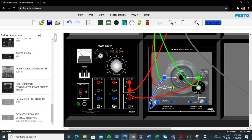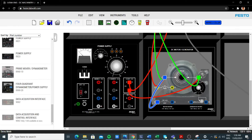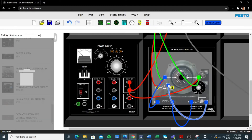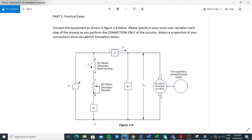This is a shunt motor, so this is the shunt winding and this is the generating or rheostat part. The rheostat uses terminals six, seven, and eight. Terminal eight goes through the positive terminal I2, and then the negative terminal will go through that junction in the DC motor.